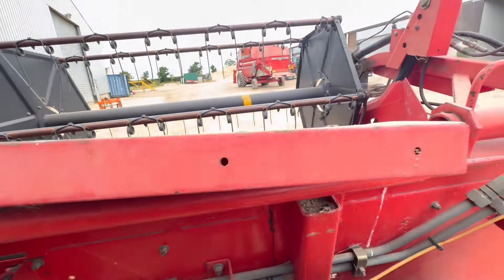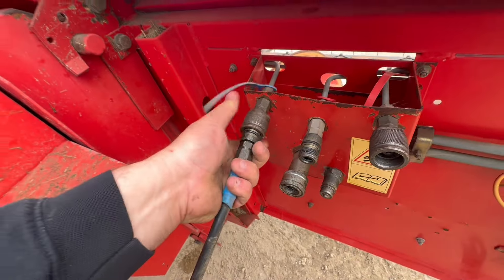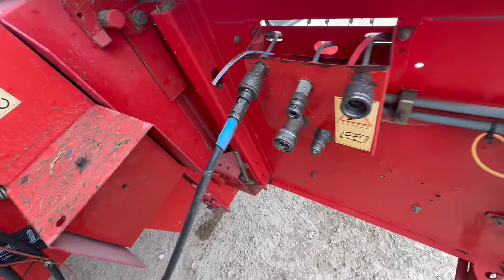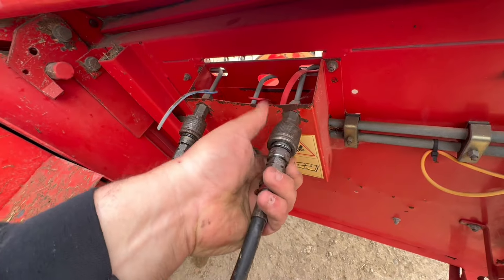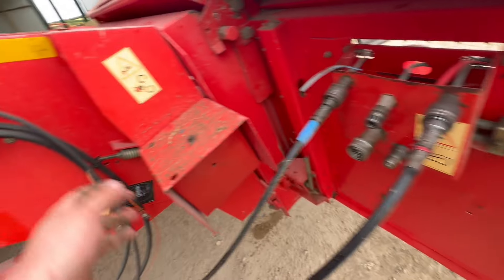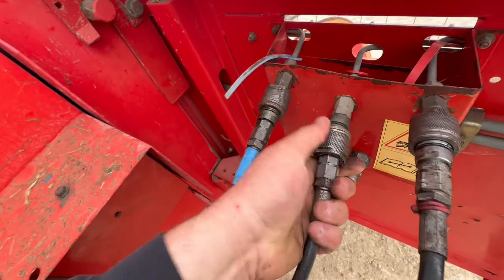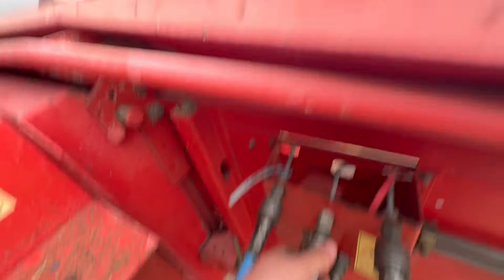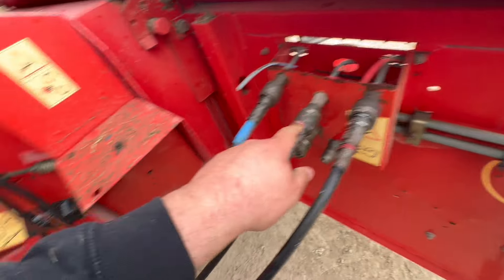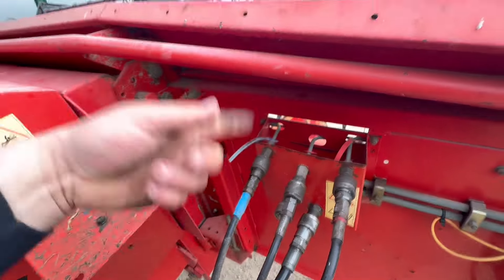Hydraulic pipes — this is for all the hydraulic motors. Blue to blue. Sometimes you usually have a big quick release that you just pull down like we do on the other tractors, but these haven't got them. We don't really use them that often anyway — you very rarely take these pipes out, only when taking the header on and off. That one will lift the reel up and down, that one will push the reel in and out. These big ones here are actually the flow for the reel to go round.